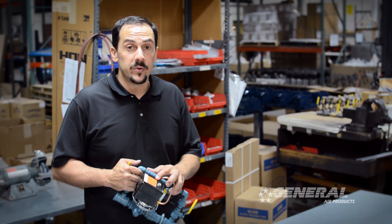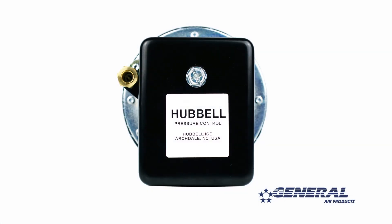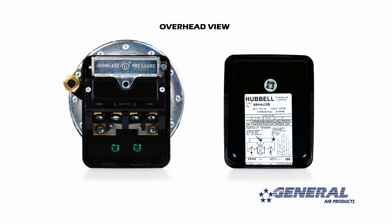The 10-pound differential must always be maintained. The key to adjusting the pressure switch correctly is knowing which parts you'll be working with. Begin by removing the cover. Note that there are pressure switch adjustment procedures inside the cover of every one of our pressure switches.